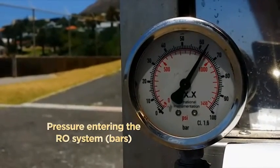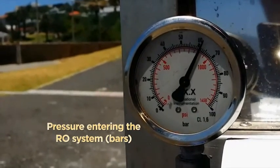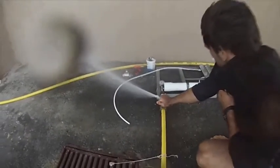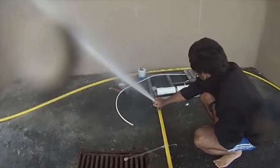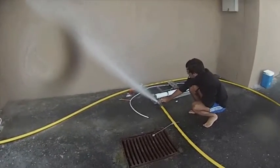The pressure shown is 63 bars, ideal for the attached RO system. The system pumps seawater at high pressure, which can be used directly — singly or in combination — to pump high volumes of low-pressure seawater for mariculture, to generate electricity, or to produce fresh water by feeding the pressurised water through a reverse osmosis unit.